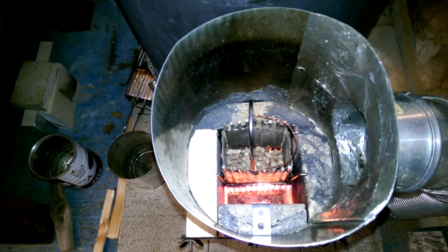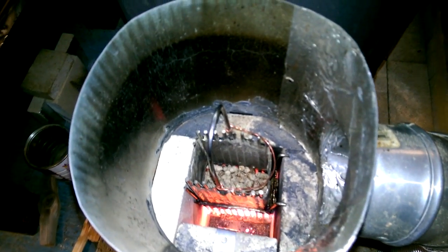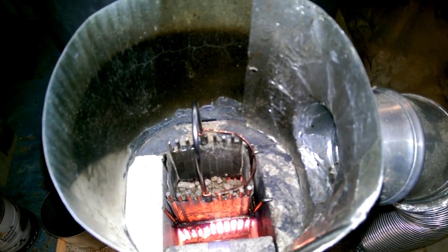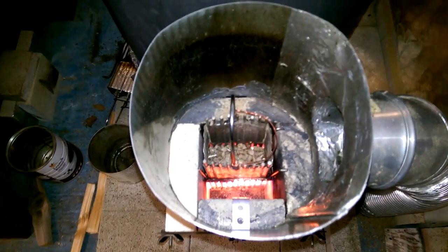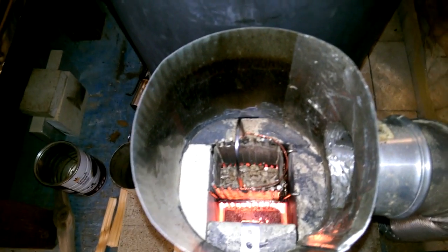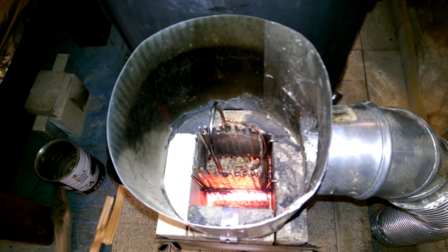You can see that the level of the pellets inside my fire basket is about three inches below the top rim, where my downspout hangs in front — a little copper wire hook just holds it in place. The actual burning is taking place down low inside there. Even though the pellets have dropped down that far, we still haven't reached the point where the pellets are actually burning. That's why the top of my pellet basket stays cool and why I never get any burnback going up the feed tube and the downspout at all.